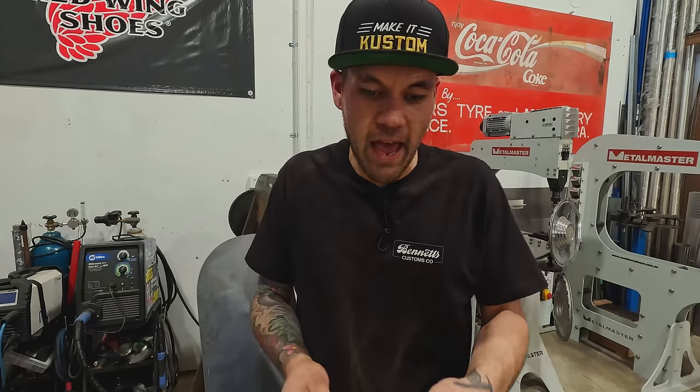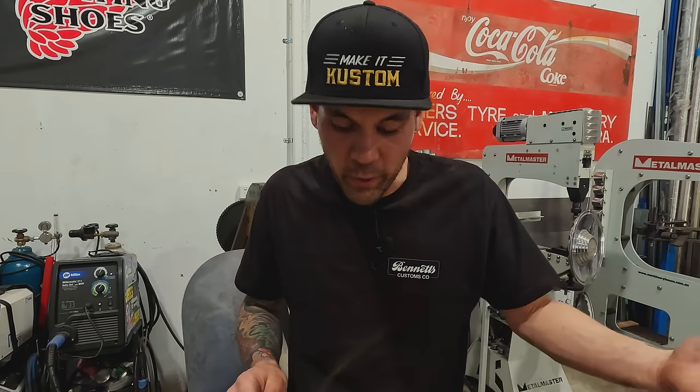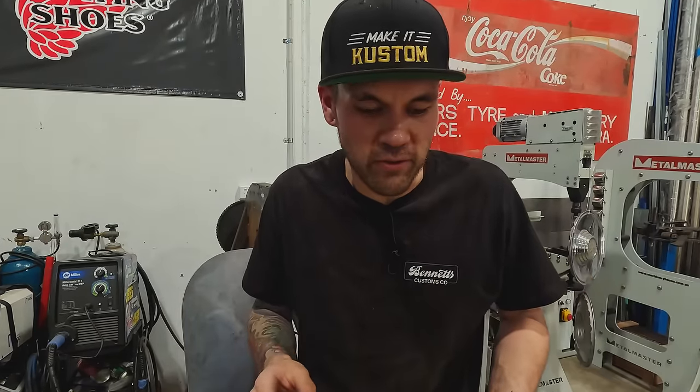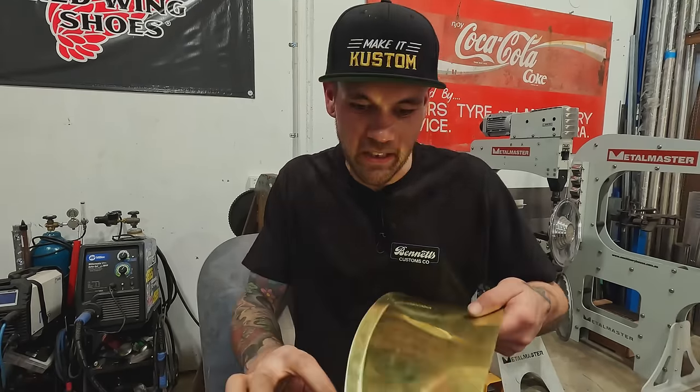As of right now, we haven't hurt the surface finish of the brass at all. We've transferred the beautiful wheels and we haven't hurt it. So if we wanted to polish this, we could. I really don't wanna have to use the shrinker stretcher, so I'm gonna have to be very careful, very lightly using the flat anvils on the English wheel to get a little bit of stretch in this flange.